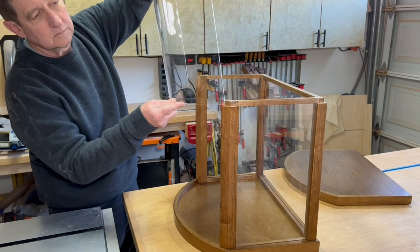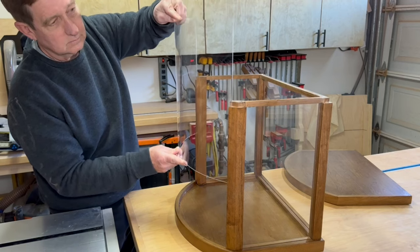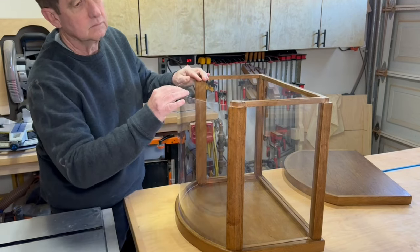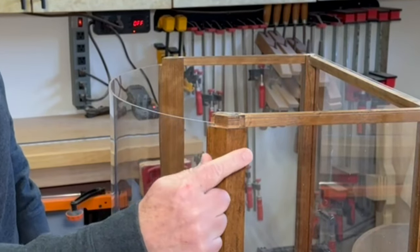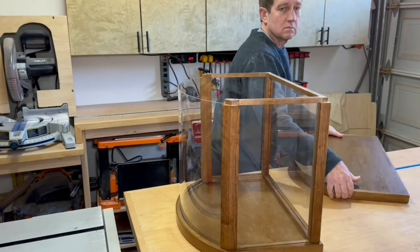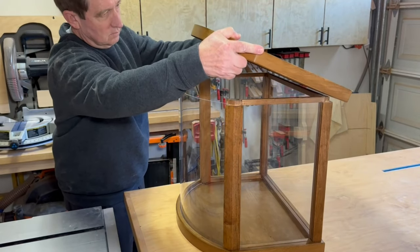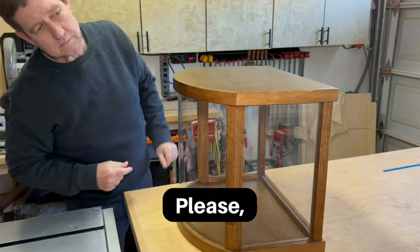Here's the finished piece as I slide it in as the front panel of the display case. Remember I mentioned that acrylic shrinks about one and a half percent when heated — you can see how much it shrank compared to the side piece, even though I cut both exactly the same size. It still falls within the overlap of the wood frame, but just barely — a bit shorter than I'd like. Overall though, I'm pretty happy with the result.